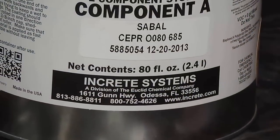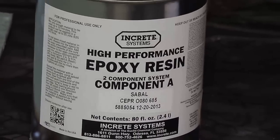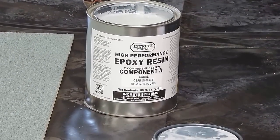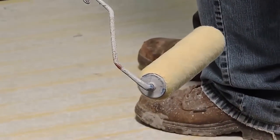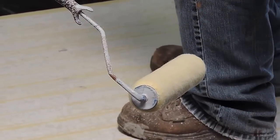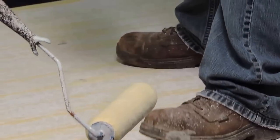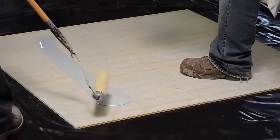But while you're making it, if you're doing a bigger epoxy job, you want a guy mixing and a guy putting it down. Because you got to cut in the garage or the room with the epoxy and then roll it or squeegee it out. And you don't want to re-temper it. You want to just put it out. Yeah, if you're leaving it in the pot, you got 5-10 minutes. You pour it all out, you got 20 minutes. Right. And usually you have one guy mixing, one guy putting it out.